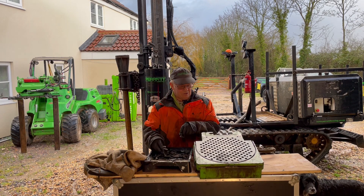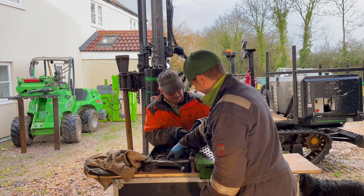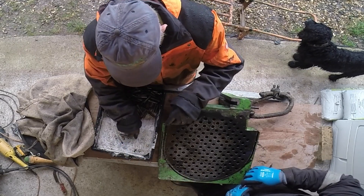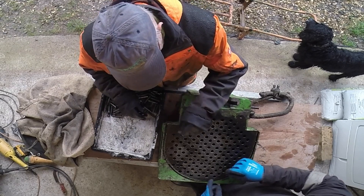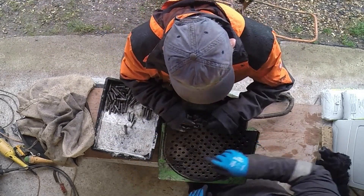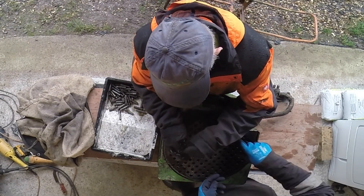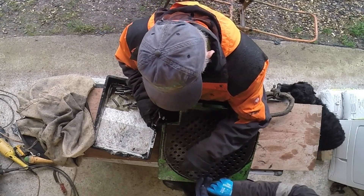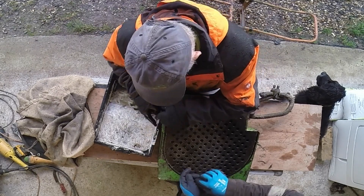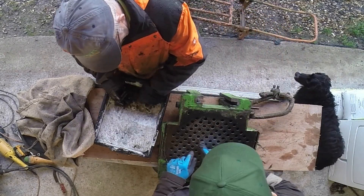The next stage is to put all the pins back into the holes. Working in rows, there are nearly 150 pins depending on the size of machine — bigger machines have up to 180 or 200 pins. A kind of acceptable tolerance would be about 10% of pins per service change. We have some people who hardly damage any, and others who damage more. As we put the pins back in, we visually assess them — machined well and ready to go. Any slightly bent, frayed or damaged ones we take out and replace with new pins from our website.